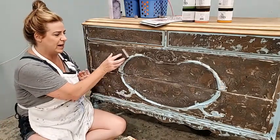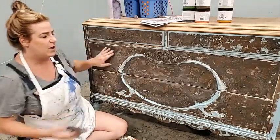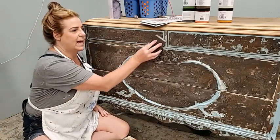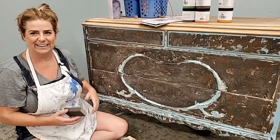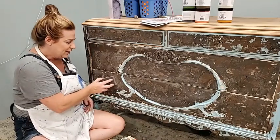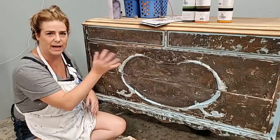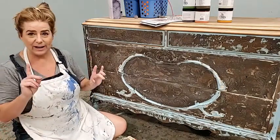I did a sanding after that — I used my power sander, not a sanding sponge. I went over all of it, but I'm not sanding so much that I knock the texture down. I just want to remove really high nubs — the kind that could catch your shirt. So I just took down anything abnormally high, just a single pass with the power sander. Now, what colors are we going to use?